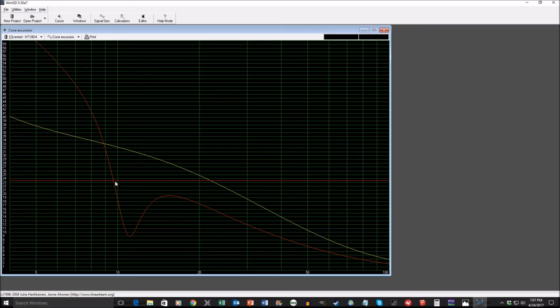And I actually stopped running with any sort of high pass filter. I just have it unfiltered, and I haven't had a problem with anything bottoming out below that. I'm sure there might be some content where that could happen, but I haven't experienced that yet. But with the sealed design, you're going past XMAX well before you get anywhere near the single digit frequencies. That's why you need several sealed subwoofers in order to get down to the single digits, because in order to protect your driver from over excursion, you're just going to have to go with more.